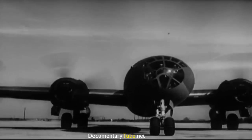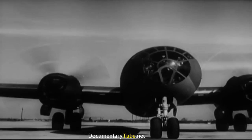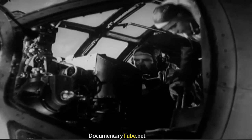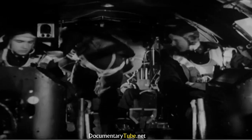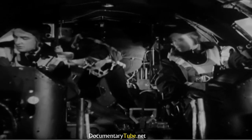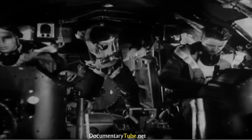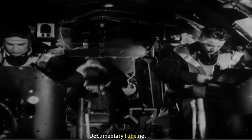All right, we're back where we were before. Tell the bombardier to come forward and open the bomb bay doors. The doors should always be kept open when the ship is standing still to prevent the accumulation of gas fumes. Next, turn off all the switches. Then you can get rid of some of your equipment that remains inside the ship and climb out for the after-flight inspection.